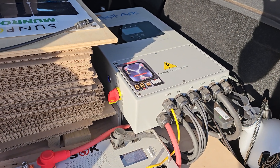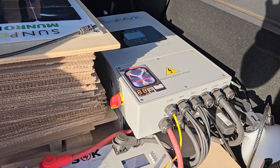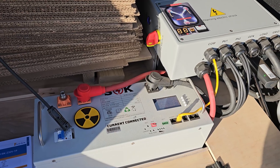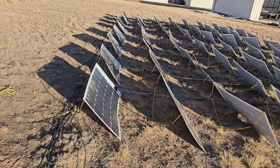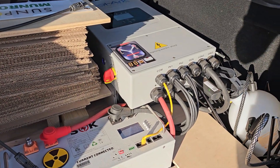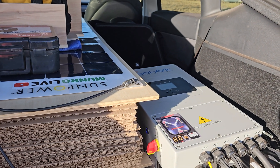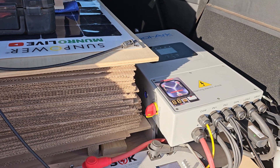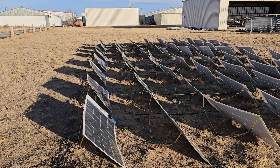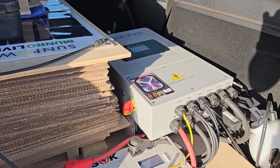So what I like to do is charge at just under 5,000 watts — it's actually 18 amps at 240 volts on the vehicle. You have some losses through the inverter and then losses through the battery, so by the time you get to the battery it's almost pumping out its rated 100 amp capacity. That allows for a cloudy day or intermittent clouds — I can still charge without the system shutting down. The downside is on a really sunny day when I'm getting 6,000 watts of solar and the battery is fully charged and I'm only drawing 18 amps to charge the car — about 4-plus kilowatt — but producing 6, the battery fills up and I can't use all that energy, so up to 1,400 watts gets left on the table.